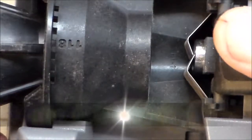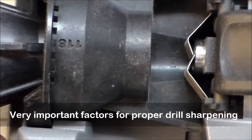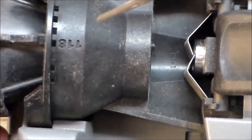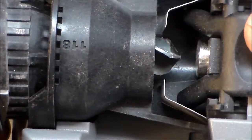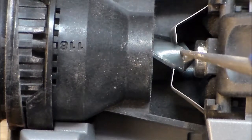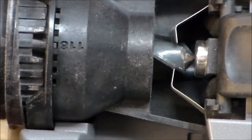There's one important thing to emphasize about the operation of this machine. When you place the drill bit and collet into the machine, make sure this dog ear right here is at 118 degrees, and that the drill is installed so that the web — the narrowest part of the drill — is oriented correctly, with the end of the drill up against the metal stop. Those are the critical elements. Do those correctly and the drill will grind correctly.